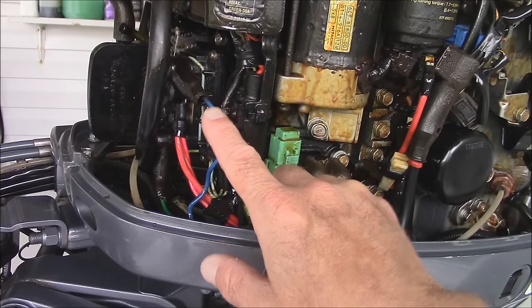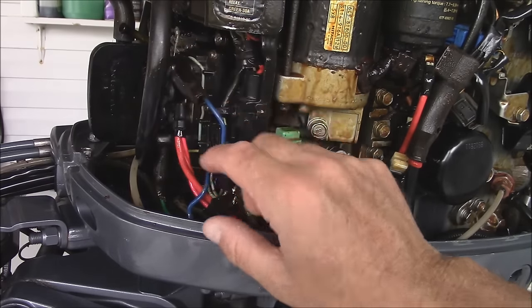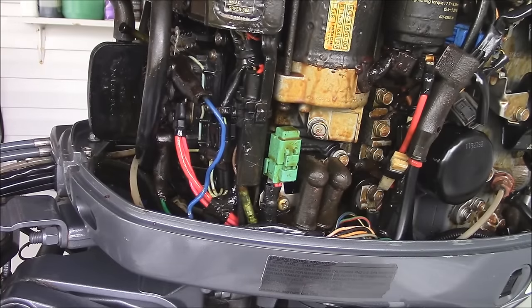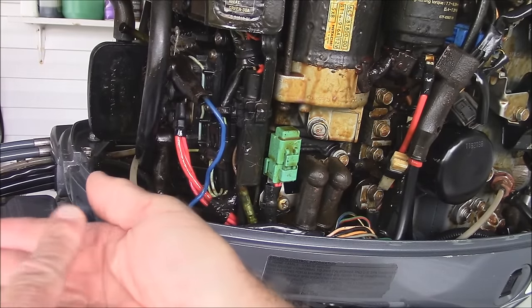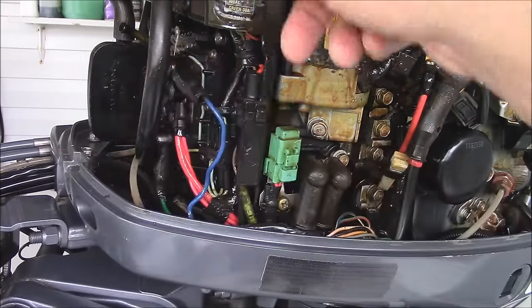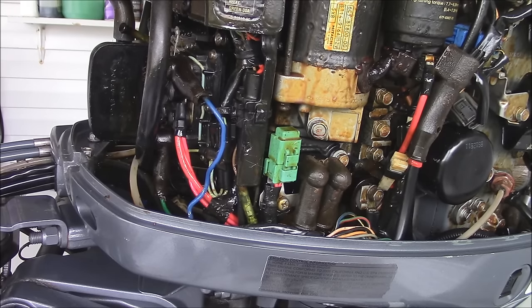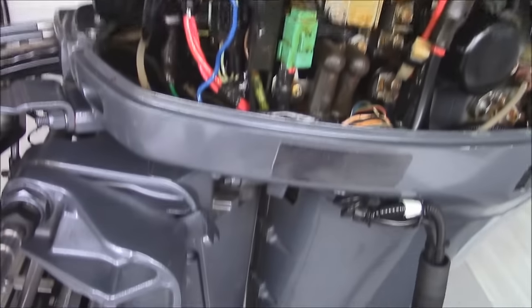From what I was understanding, you can take off the blue wire and take off the green wire — you can't test this with them on the relay. Take the blue wire, positive it out on a battery, ground out the engine block somewhere — run a cable to somewhere on your engine and ground it out. That will narrow down whether it's the relay or the trim tilt motor itself. If you hook up the blue to positive, ground it out, and the engine doesn't raise, that pretty much tells you it's probably your trim tilt motor.